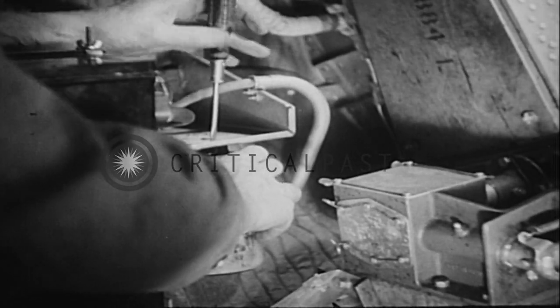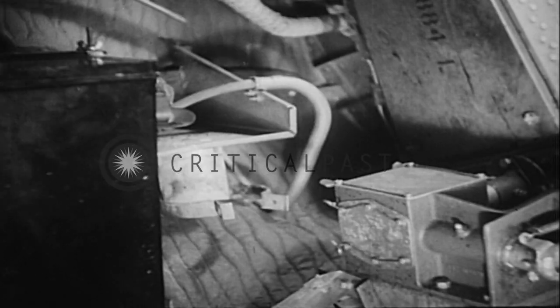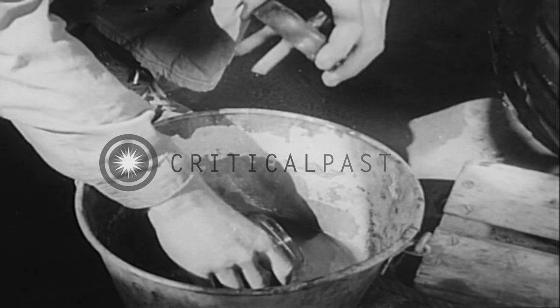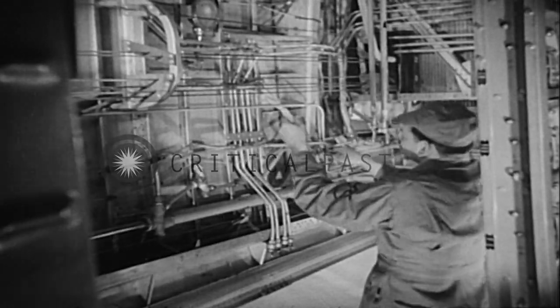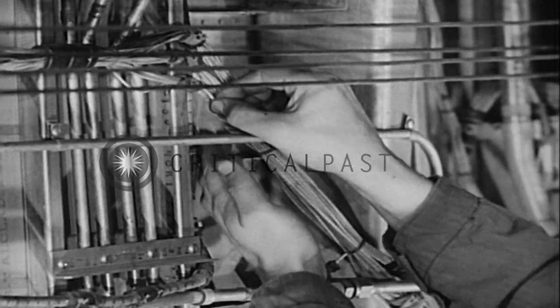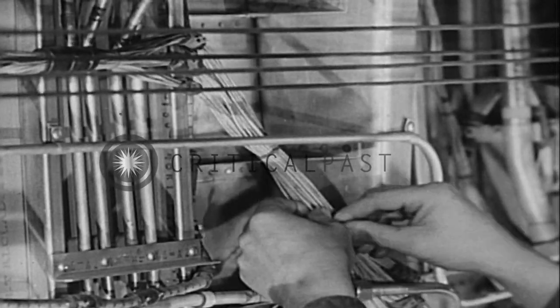Then, continuing with the inspection, he turns to the sump in front of the batteries. The sump is removed so that it may be thoroughly cleaned. The cleaning job is taken over by Chandler, who proceeds to give the sump its soda water bath to clean it and to neutralize acids. Moore's next job is to check all accessible electrical leads. He traces them down to see that they're properly anchored and supported. One has sagged to a point where it's apt to rub on lines and cables and cause trouble, so he pulls the lead back into position to eliminate any possibility of danger.